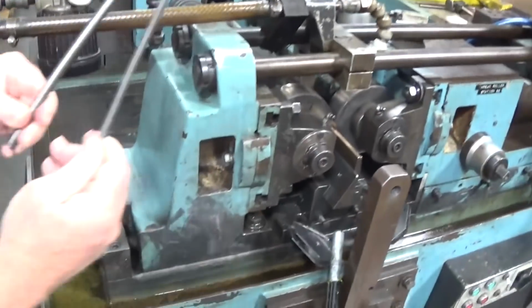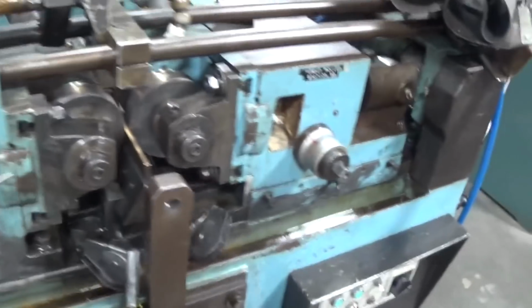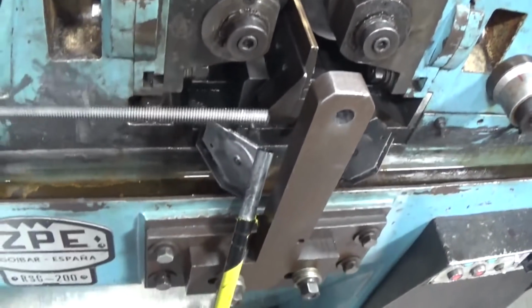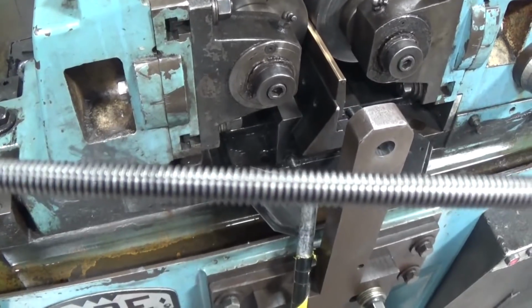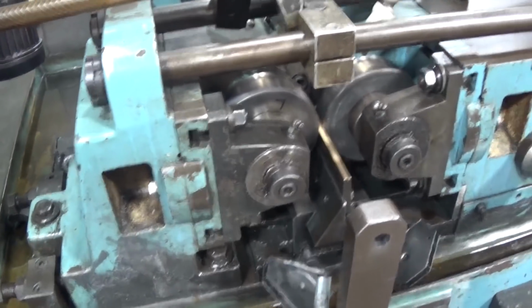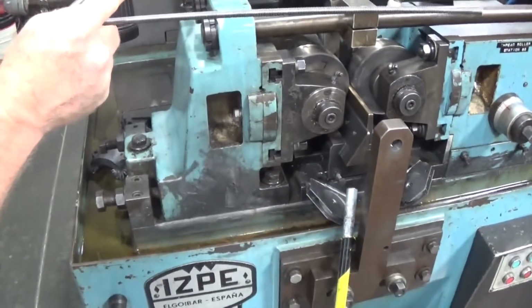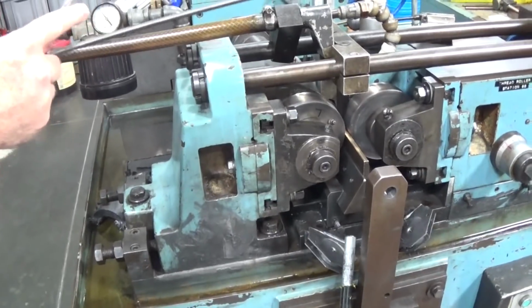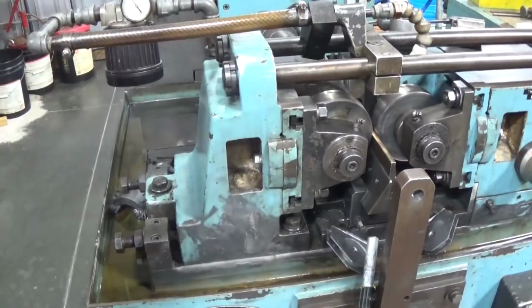These are examples of different diameters. This would be for an X or a Y axis. This would be for a Z axis on a mill. It's a really nice thread. The long material passes through here. They take it out, cut it to size. They'll put a taper on it to accept either a coupling from the hand wheel or the stepper motor.